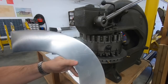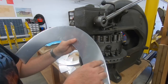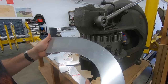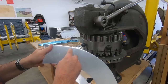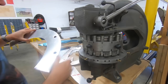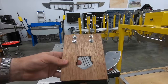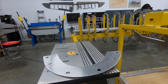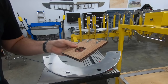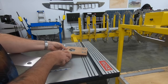So we cut out our flat patterns — you may be able to see there are marks from the laser where each of the stringer locations are. We've got a router template for that, so those will be routed out, but to get them started I use the Rotex punch to punch a hole and take the bulk of the material out. We'll do this for every stringer cutout on each of the segments, then go back and set up the router for the final trim. For the stringer cutouts I've made templates — there are two of them. Frame JK uses just one size stringer cutout, and you just line it up and you're good to go. With the punch-outs in place, the router bit can come through and trace it out.